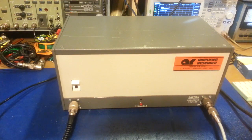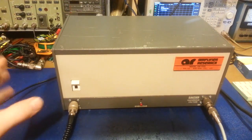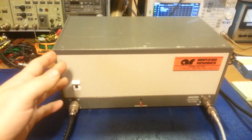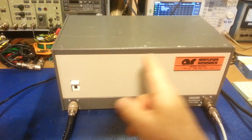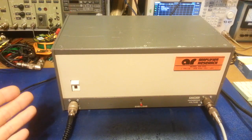When you get up into four-digit wattage levels, those amplifiers are enormous — usually two or three cabinets taller than I am, and I'm six feet tall. They're so big because they're wideband and there's a massive amount of circuitry and transistors inside. This unit has a higher amplification factor than most radio amplifiers, with several stages. I had the top cover off to dust it out and clean it before putting it in its permanent home — I believe it's seven or nine stages of amplification. Each stage uses progressively larger transistors, starting with a tiny pill and working up to a large square block transistor by the final output stage.